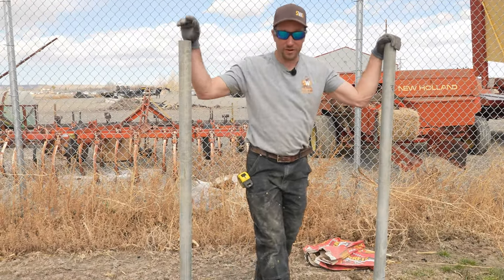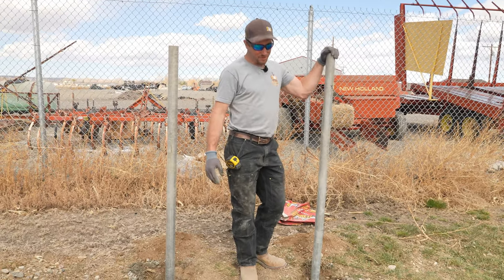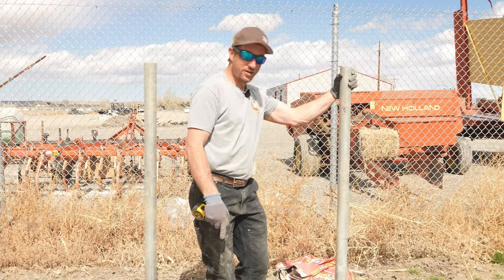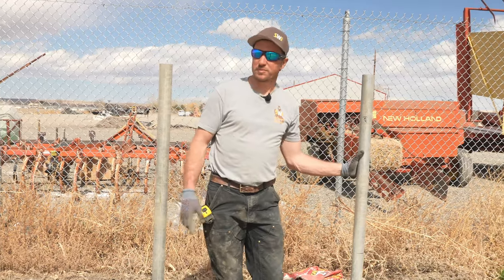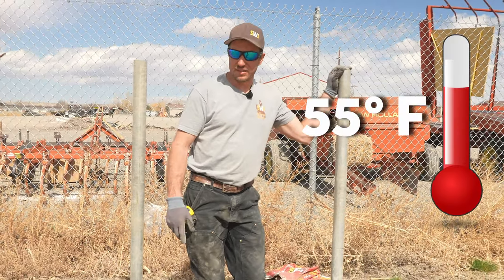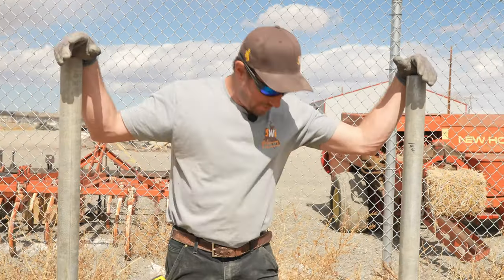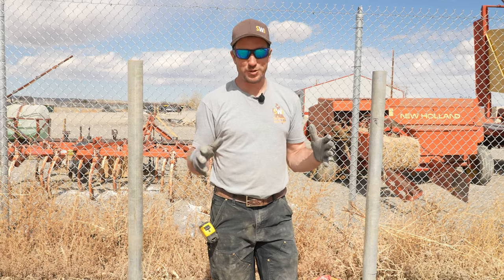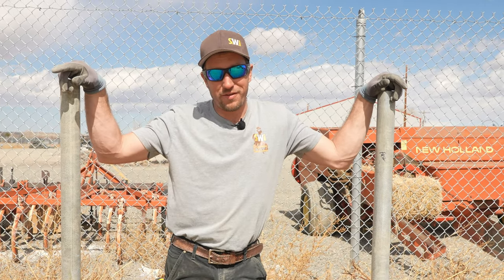Great, wonderful product. If you're in a hurry and trying to get a repair done in one day, just remember to be very gentle with it — don't cause it to fracture and try not to break that post free. Earlier I said if you wait an hour you could start working on it, and I 100 percent stand by that. Also keep in mind today's temperature is about 55 degrees, so if it were even hotter it would cure even harder. Thanks for watching the comparison. If you want to see the real interesting facts between wet set, dry pack, and foam, make sure to see that video. This is Dan with SWI — we are Wyoming's fence company, and you have a good dang day.